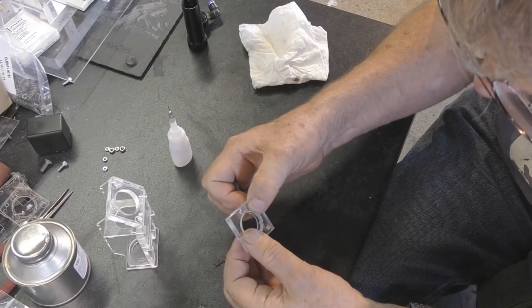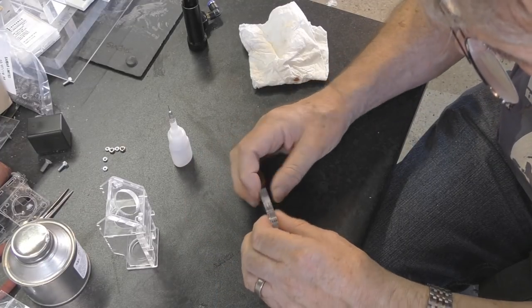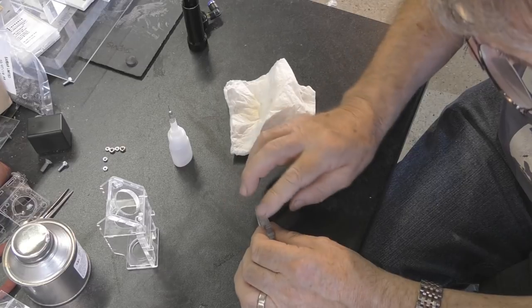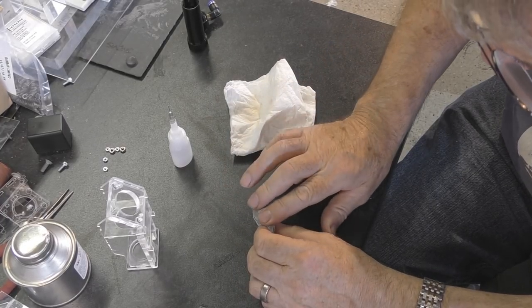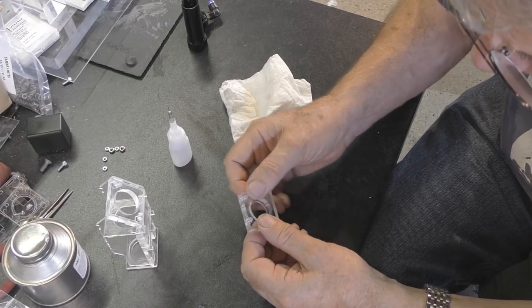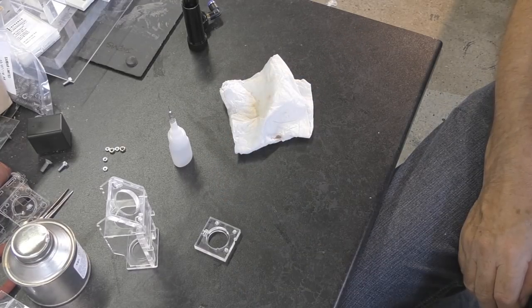We take the piece with the three hexagon holes and lay it down so the square slot is at the top with an L or backward-L shape, notches on the bottom right-hand corner. Next we put on the two pieces with slots at the top — they line up with the holes and the notch along the bottom. Finally on top we put the last one, again making sure we get the notch and the backward-L shape. We hold them together so the edges and top and bottom are level, flood the top edge with glue so it goes down between the plates, and hold it together. After 15 to 20 seconds you can square the whole thing up.